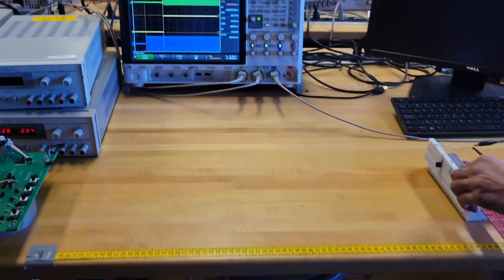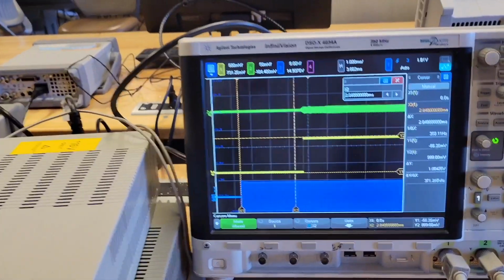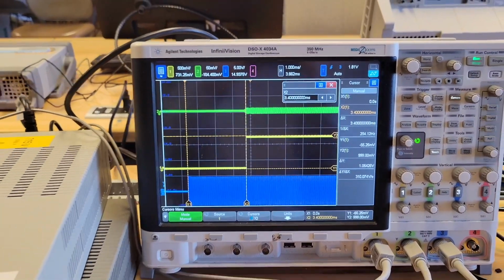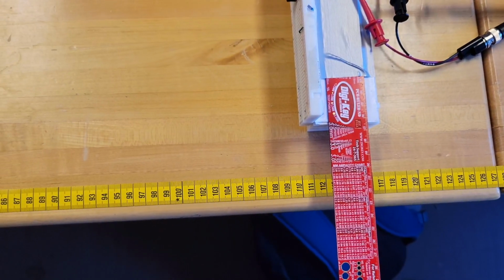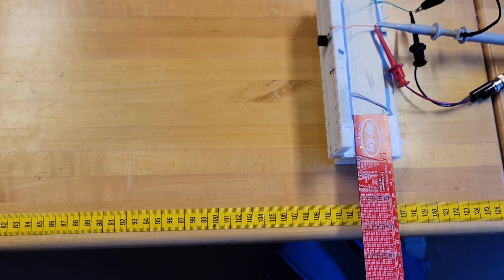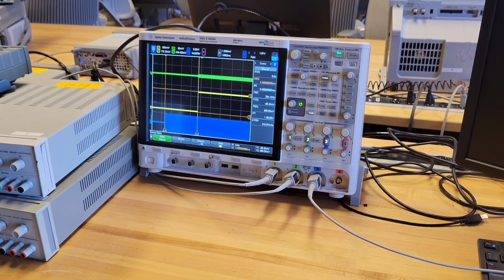Let's carry out a higher distance measurement to wrap up our demonstration session. Okay, so here we have approximately 3.4 milliseconds of delay. Let's feed that in our calculator, and we see that the distance is around 114 centimeters. And the actual distance is approximately 112.5 centimeters. Again, we are fairly close. Some sources of error in our setup can be multipath interference and also the least count of the oscilloscope, which is around 20 microseconds, corresponding to 0.7 centimeters.